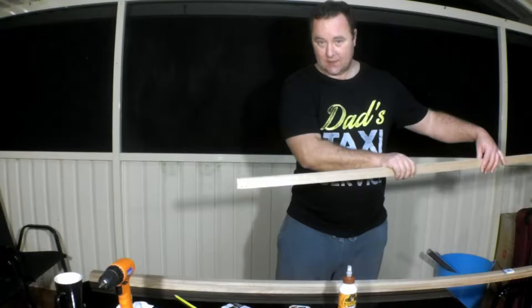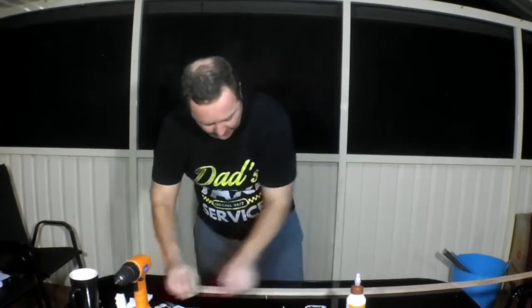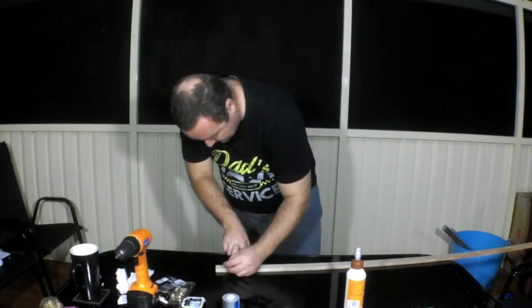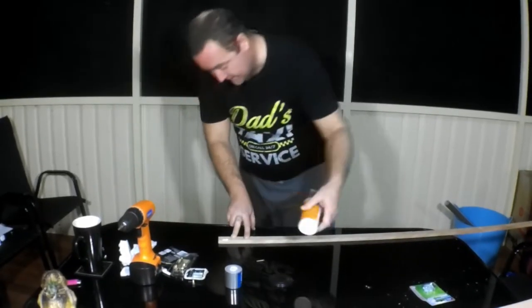Now is the gluing phase. I've already drilled all the holes — keep in mind, only half-drilled. I accidentally went right through one of them, but it's okay. I'm going to use a bit of stinger tape to hold the glue in place with the screw, and the screw is going to go through regardless anyway, so it's not an absolute disaster. Because this glue takes about half an hour to set, and it's wood glue so it's quite strong — we don't want to get it on your fingers, so be careful. I'm going to clean the holes out of any debris or wood fragments first, make it nice and clean, then squeeze the wood glue just on top like so.